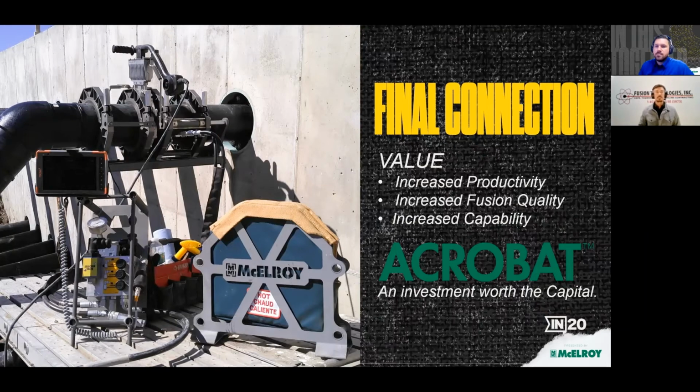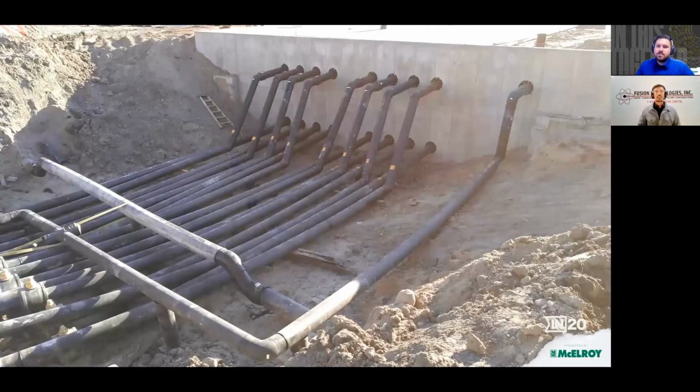We estimated this project with ASTM F2620 and conventional fusion methods of 11 minutes of cool per inch wall thickness, but then we actually brought in the data logger 7 with the DL6 software and used MOC. So we were able to put the project back on schedule and get back on track and finish this on Friday afternoon, which was awesome.